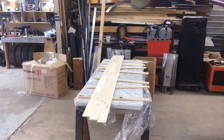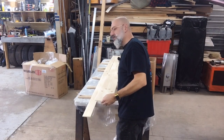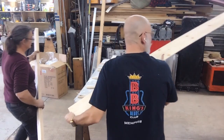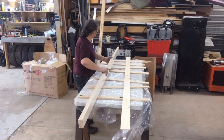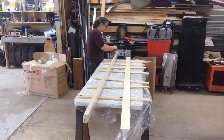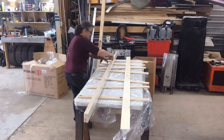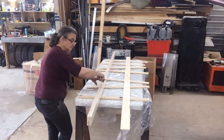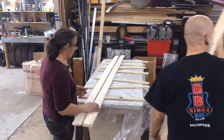So if you're putting wood like this in your home, in your bus, in your van, whatever, you want to make sure that it stays at relatively the same humidity level. So if you're not heating your mobile home on wheels year-round, you'll want to still control the humidity somewhat so your boards don't end up either cracking from being too dry or warping and actually forcing themselves off the walls and getting too damp.